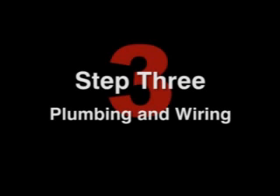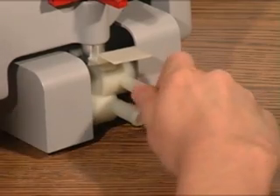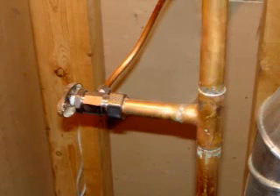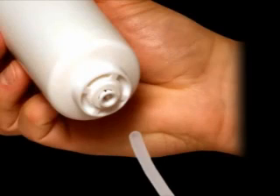Plumbing and wiring True Steam is the same in both duct mount and remote mount applications. Shut off the cold water supply. Attach a ¼ inch copper or plastic water supply line to the solenoid's inlet water port. A saddle valve is provided to tap into the water supply; a T-fitting may also be used. True Steam comes with an in-line water filter with fast push-button hookup — it requires no tools to plumb in-line with the water supply. The filter will remove sediment and minerals from hard water sources.